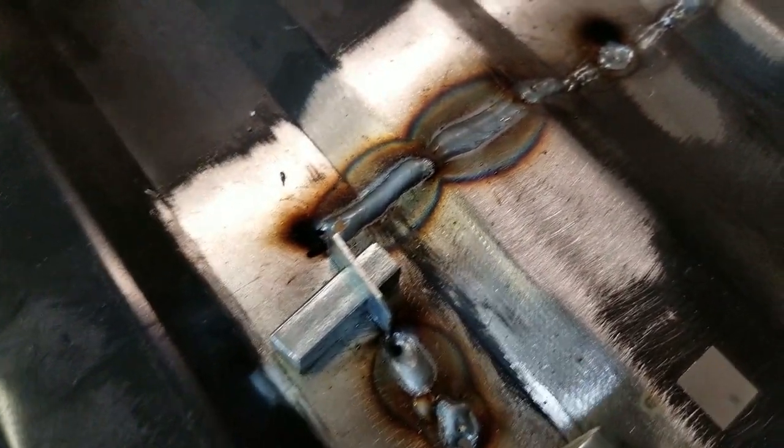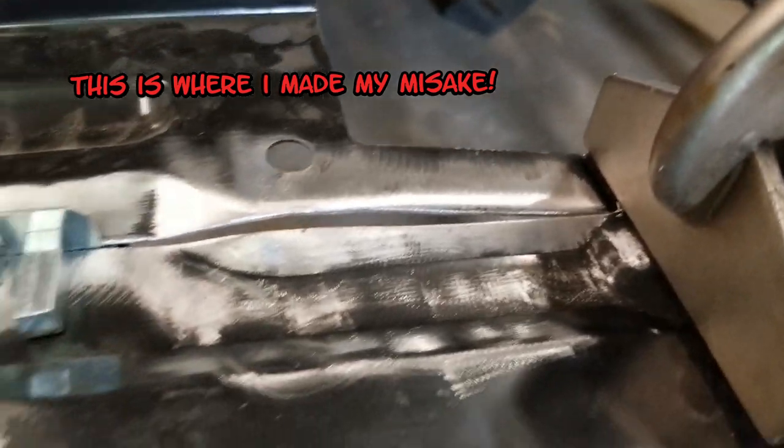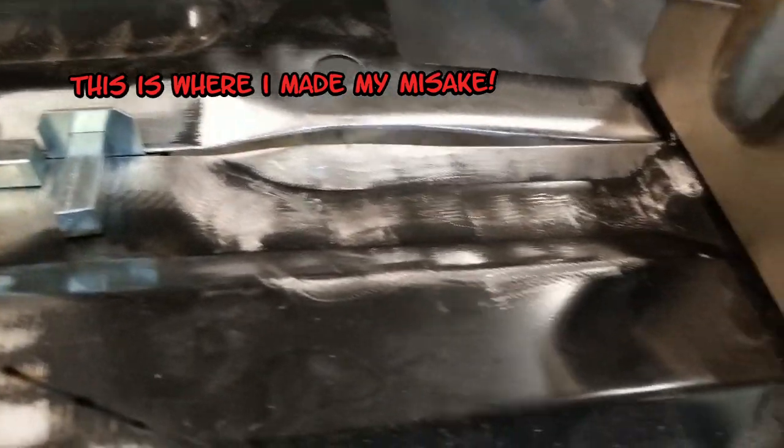Here's my progress — I rearranged these clamps down here to align some of the areas I really wasn't too happy with. I used a regular hammer and dolly technique for the rest of them. Yeah, it looks like I got some pretty decent penetration. I know my welds aren't all that, but I'm not a welder — those ones look all right though. It's gonna hold. There's a lot going on here so I hammered and dollied a lot of it back in place, made a couple of holding welds, and then smoothed it back out.